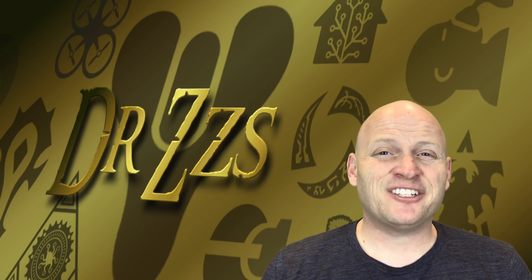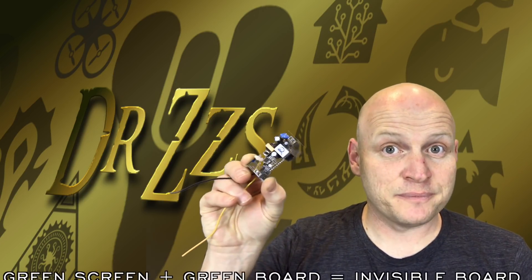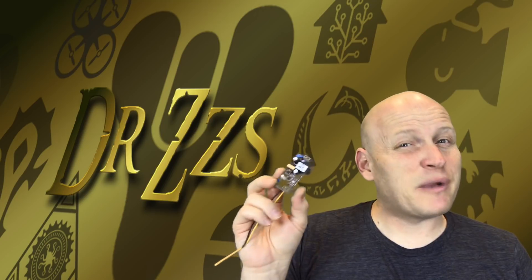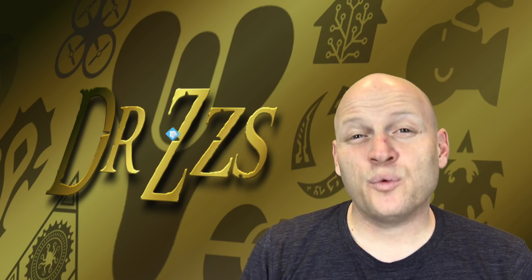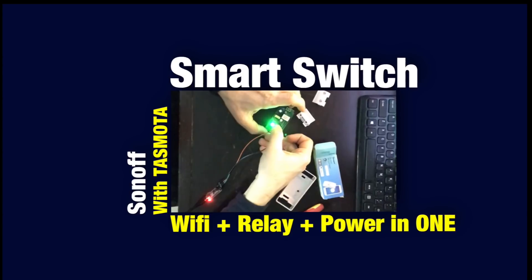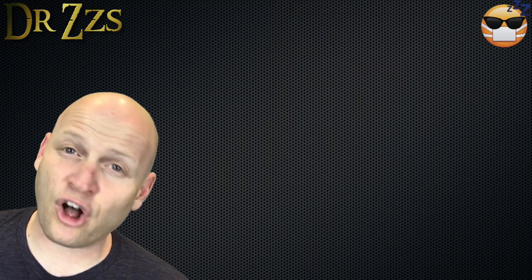One of the best things to do in home automation is to turn things on and off remotely, especially lights. The easiest way I've found to do this is the Sonoff Basic. This little guy has a Wi-Fi chip, a relay, and a power converter for about five bucks. The best part about the Sonoff is how flexible and capable it becomes when you flash it with Tasmota firmware, which makes it easy to connect and control with Home Assistant. All credit goes to Theo Arend for making this Tasmota firmware — it's really good. Sonoff should seriously pay him a gajillion dollars and just put his software on all of their switches.